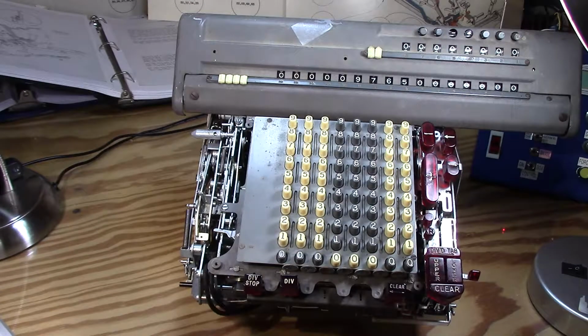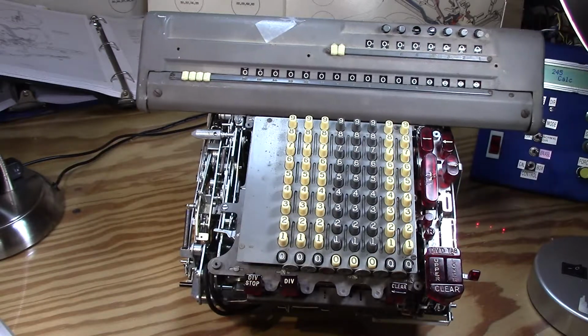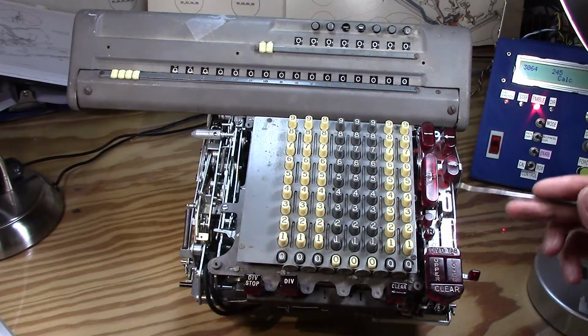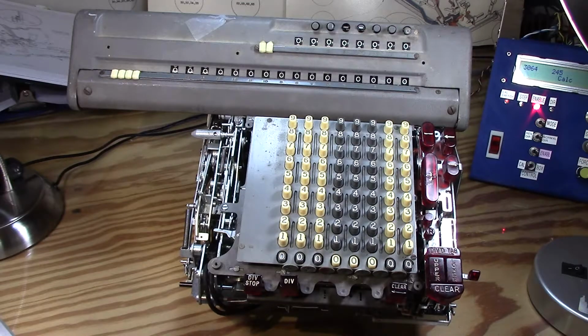So anyhow, I think that's it. I'll start working next on divide, and that's it for this episode from the Id of Ed. I'm getting close. Addition, subtraction, upper, lower, clear, this clear, repeat, simplistic multiplication that isn't really as automatic as I'd hoped, all work. I think I'm really basically down to just divide. And then I guess I've got a fully functioning, budget-ish, highly automatic mechanical calculator from, I'm guessing, the early or late 50s. I still ought to try and nail down when this was actually made.